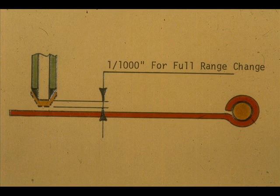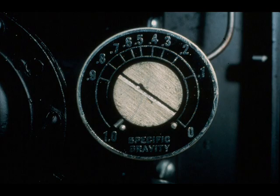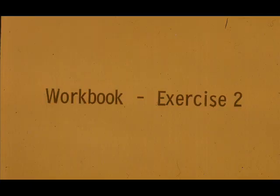The artwork illustrations have exaggerated the flapper and nozzle relationship for clarity. It should be remembered that the flapper and nozzle relationship for a 3 to 15 PSI change is in the magnitude of thousandths of an inch. The movement of the feedback Bourdon tube is also very small. We now have a complete transmitter. It has a coarse span adjustment, a fine span or specific gravity adjustment, a coarse zero adjustment or alignment screw, and a fine zero adjustment. Now work exercise 2 in your workbook.